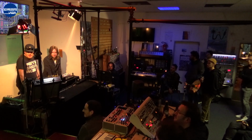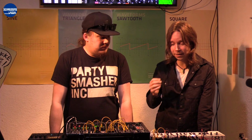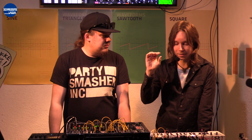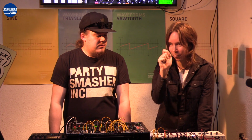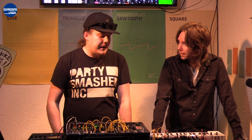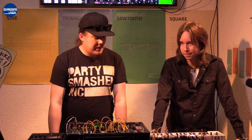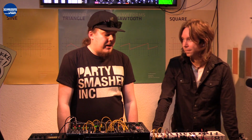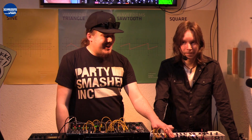So it's not super deep. I think it cannot be more skiff friendly because the height is exactly the height of the potentiometers to the circuit board, and then there's the power connector on the circuit board. That's what makes up the whole depth. Is it the single PCB with the pots and the power connector? The highest component is 25 millimeters, I think. That was one of our main points in physically designing this. It's really packed on the one PCB, but it fits there.